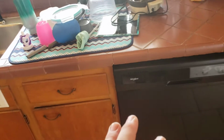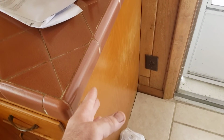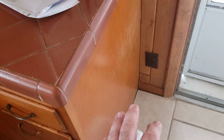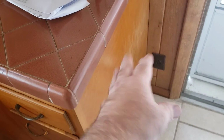We won't know until tear out about how far away that dishwasher can be put. And one thing I noticed here, that's actually a 220 volt plug that's down low. So really the length of the cabinets on this one would have to come all the way within an inch of the door trim and cover that plug, and the plug would actually have to be blanked off and removed from the fuse panel, or it's got to stay at 24 before it, just like you see.